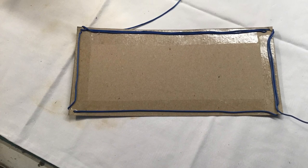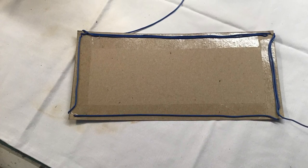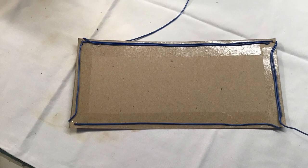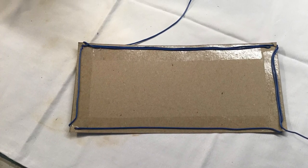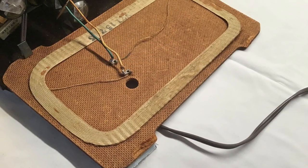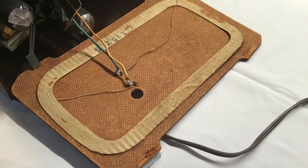A couple of turns would probably work better. You can see I've got about two and a half turns of wire. The orientation of the wire itself is to mirror what's there for the loop antenna, so keep that in mind.